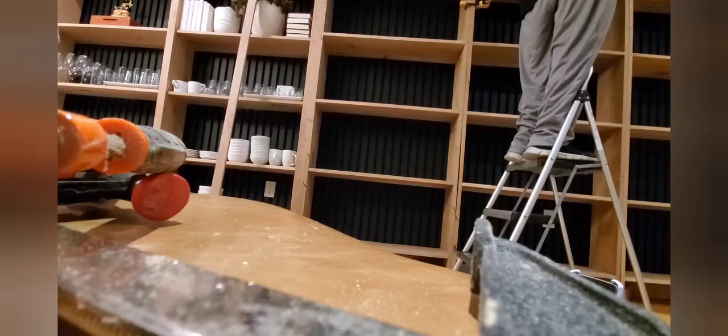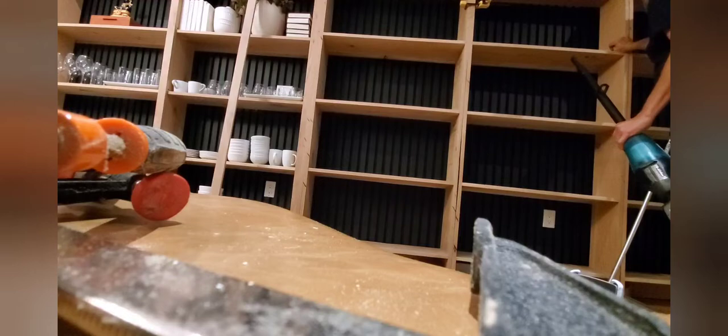He wanted brace screws, and also we're going to brad nail little pieces of trim up over each seam. So it's almost like a quasi face frame, but not over the shelf pieces, just over the vertical long pieces where there's two pieces, shelves connected to each other. So there's no seam, covered with any imperfections and everything like that.